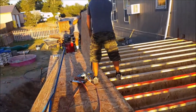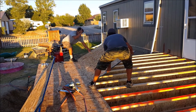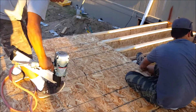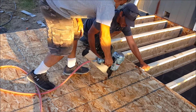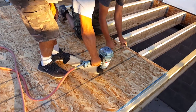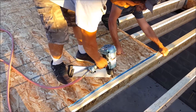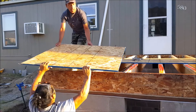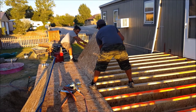I would recommend getting three-quarter inch tongue and groove subflooring, which will make the subfloor even stronger. Unfortunately in my area the tongue and groove flooring was on backorder, so I had to use standard three-quarter inch OSB. I will also be installing some quarter-inch underlayment on top of this eventually, which will make the floor plenty strong enough. While installing the subfloor, you may need to adjust each i-joist slightly to keep everything centered on your on-center marks. Also, the long side of the subfloor should run perpendicular to the i-joist, and you should stagger the seams so they don't line up with each other. I started my first row with a four-foot piece and my second row with an eight-foot piece to stagger the seams.